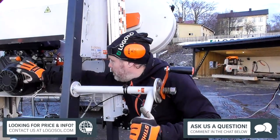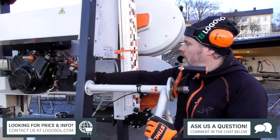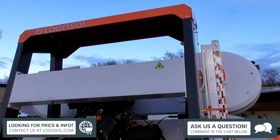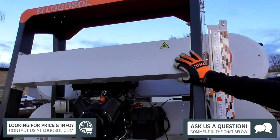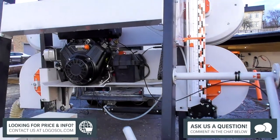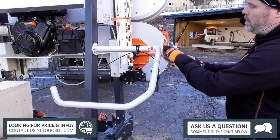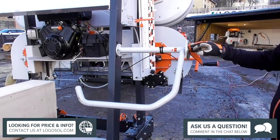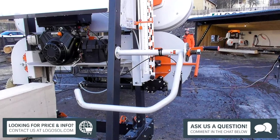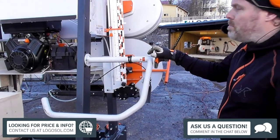And this is what I was talking about as well. We have the motor, we have the battery for the 18 and the 23 horsepower. So it's really clean here. Nothing else on that shelf. So super easy to maintain. And this massive water tank up here on the 1001. That's higher than the B751 and the B751 Pro. And a really clever height adjustment crank with these increments of 1/8 inch. So 8 increments for 1 full turn. To save time and to give you the correct and exact dimensions board after board after board.